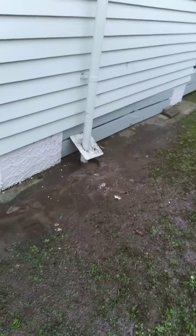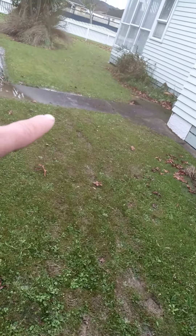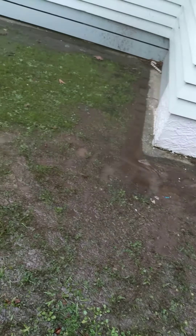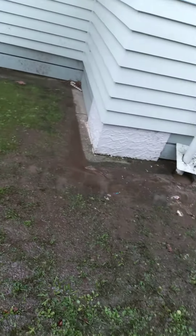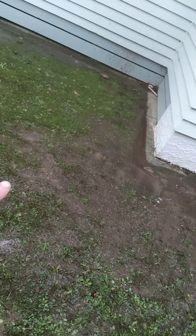The issue that we have is to get the water out of here and all the way out to the street — the street's slightly higher, so this area is always going to hold water around this part. We can only get down to around about here anyway, and this is where it started swelling up. So it would need to be dug up here, but I think you'll find she's just a soak pit sitting in here.